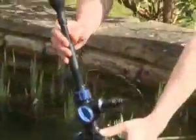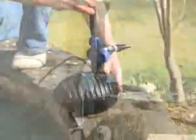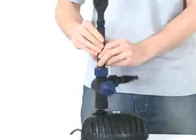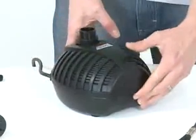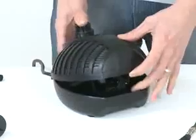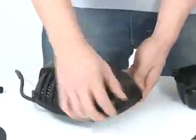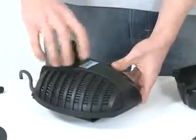work. Remove the pump from the water carefully. Do not pull the electrical cable. Remove the fountain attachment, riser pipe, and T distributor and clean where necessary. Remove the pump casing by depressing the bottom part of the casing where indicated and lift open. Remove the retaining nut from the top of the pump and remove the pump from the casing.